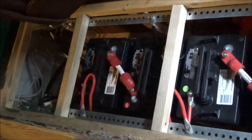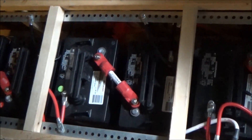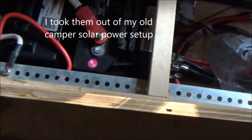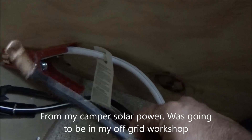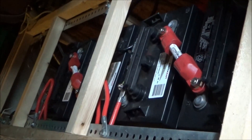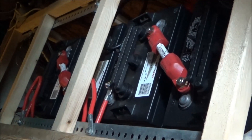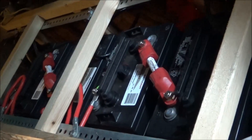I found some leftover jumper cable wires I was scrounging around — just the ends left over from when I did this whole system last year, plus one piece with a terminal on it from some under-hood work. It's just enough for me to extend this. I'm going to double up the black wire going on the power inverter. Hopefully if my theory is correct, I was only drawing off the front set of batteries — they probably equalized overnight, but I don't think I was getting the full capacity out when the fridge was running.